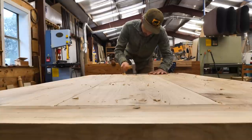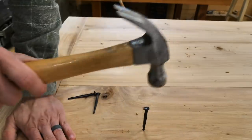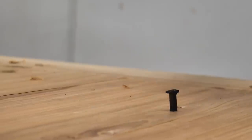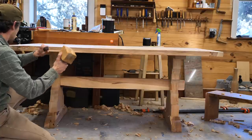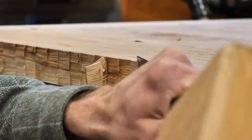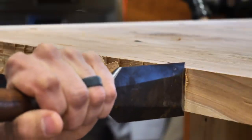So what I decided to do is get some old cut nails and just nail in the center of each board down into my upright — that's how I would attach the tabletop. I'm assuming that's how it would have been attached in the first century; they didn't have screws, they had nails. Those nails really grabbed and I don't think this thing's coming loose. This last little technique was kind of an afterthought — I wanted to have that hand-hewn look on the edge of the boards, because that's how they would have shaped timber back in the day. I grabbed that wide chisel and tried to do it — just a couple taps cutting down into the wood, then bend the chisel over and pop, split out a little section and go down the length of the table. It's a really cool interesting look and to me it looks really authentic and just fits the style of the table.